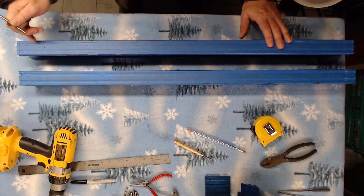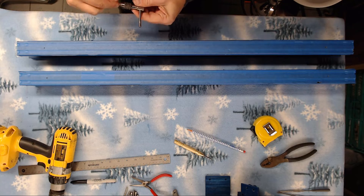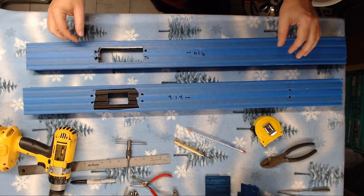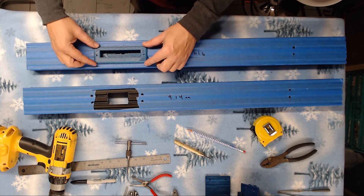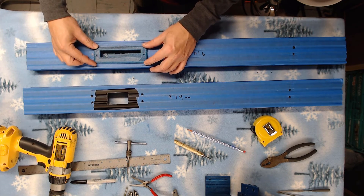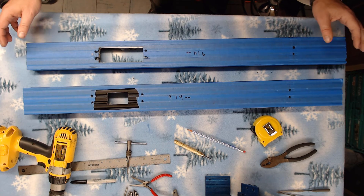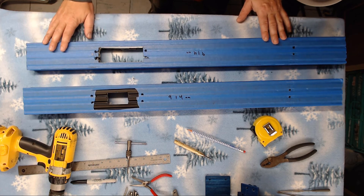I've taken the beams over to my drill press and drilled the four 2.5 millimeter holes. Now I'm just going to tap them out with a metric three tap. We are pretty much done drilling holes in our extrusions, with the exception of one spot which we can't do until it's all together. We will eventually need to drill two holes and tap them out for the thumb screws that hold the slide tray in place, but I prefer to do that after the slide tray is installed so we have perfect placement. Next thing is to strip all this blue painter's tape off and hose these pieces down to get all the little filings out — we don't want them getting on our circuit boards or in our wiring.